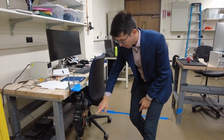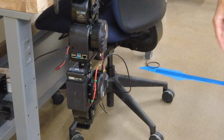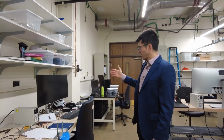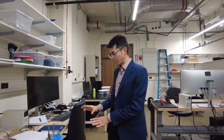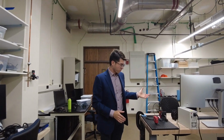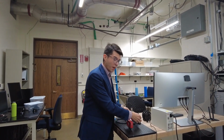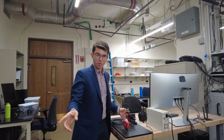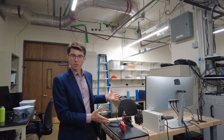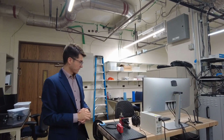This is a knee-ankle prosthesis. It has the motor for the knee, the motor for the ankle. So our first year graduate student, Mohsen Alizadeh Noghani, is developing the control strategies to do that task. We see here the workstation for our other PhD student, Kang Yang, who is understanding how to use compliance to reduce motor size and motor mass for the powered prosthesis. We use computer optimization to find the right stiffness that minimizes the motor mass.